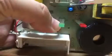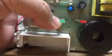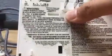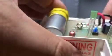You notice how they're still using that really clever little jumper wire switch up here, but this time it says the anti-tamper. When you take this off the wall, this little thingamabobber right here stops contacting the wall plate. This is held in place by the friction of the springs in the outlet, and then it beeps at you with the battery inside. But what's the rest of this doing?